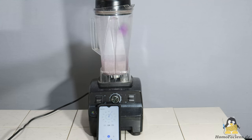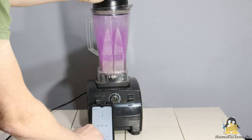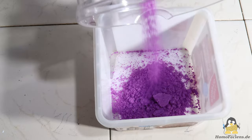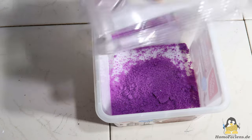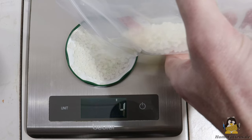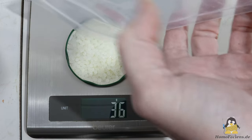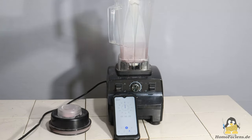This is put into the blender and the device is switched on. The container must be held firmly in place during the process, otherwise the lid would be thrown away by the ball being thrown up again and again. After 2 minutes, the container is emptied, and then approximately the same mass of industrially produced PLA pellets is put in the blender.